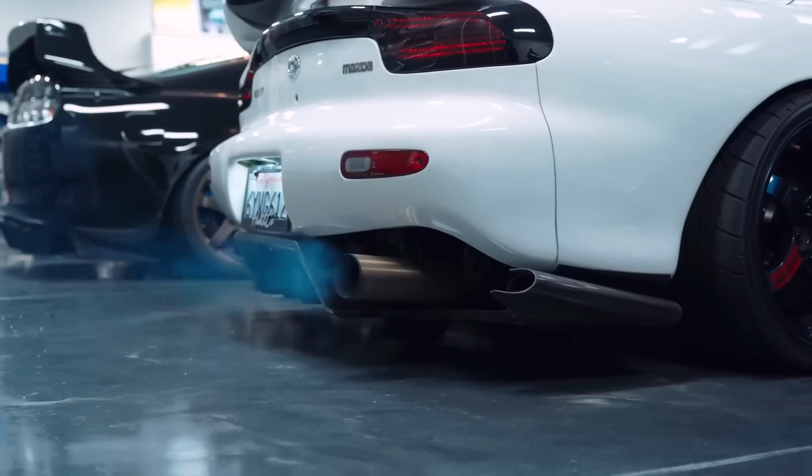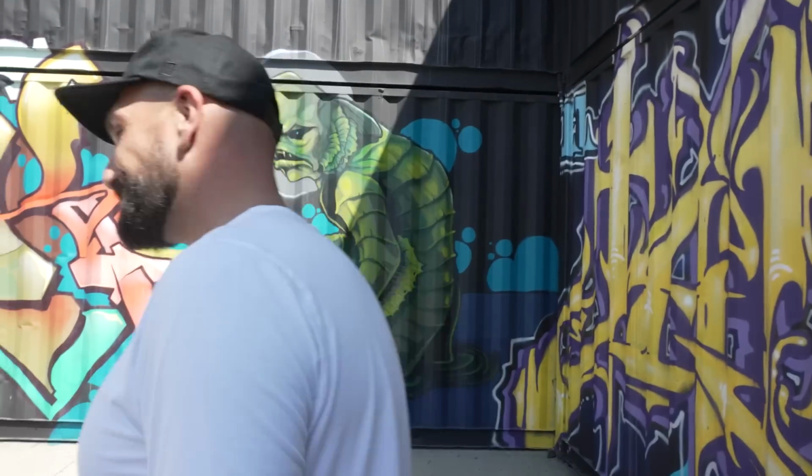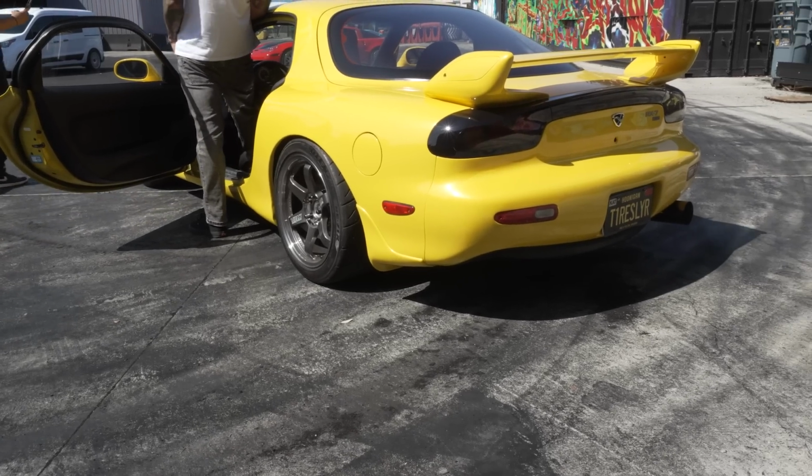So what makes rotaries lope is when you open up the ports, like a street port or a bridgeport or a semi-peripheral port. That is what gives it that bap, bap, bap, bap idle. I kind of want it. I have a spare motor that I can do it to, but stock motors are really reliable and nice. But the chop would be sick. I want the chop. Rev it up to about 9.